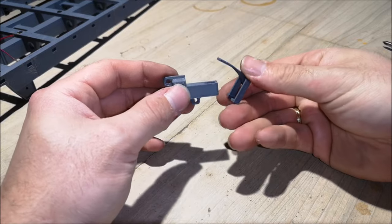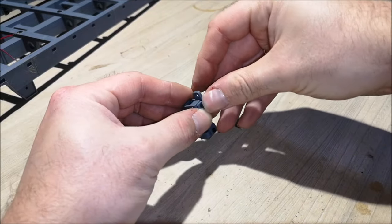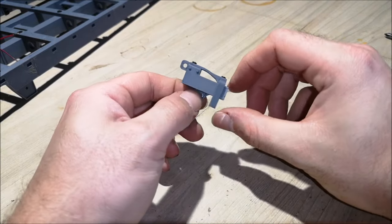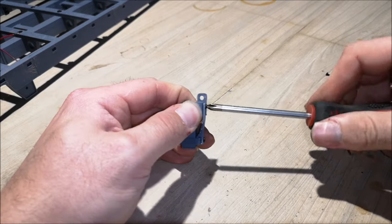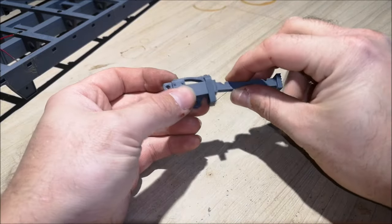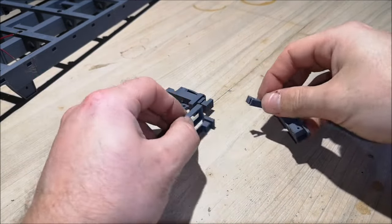Then you move this one into it like this. Then you take another 2x6 self-tapping screw. Put it in the top here. So here's the release mechanism. I'm going to have to put this one tighter in. Yeah, there we go. So now just line up these locks with the lock in here. So I'll do the other one off camera.